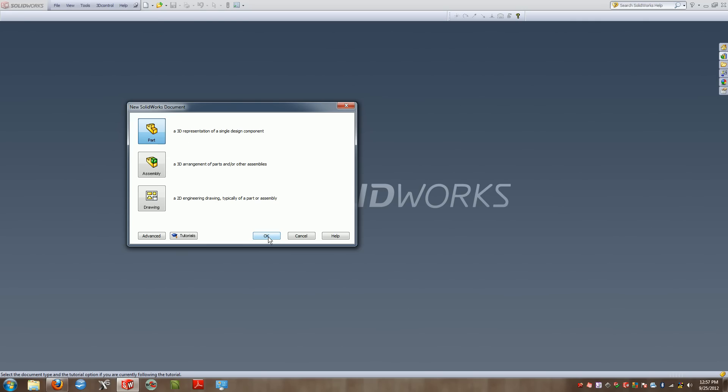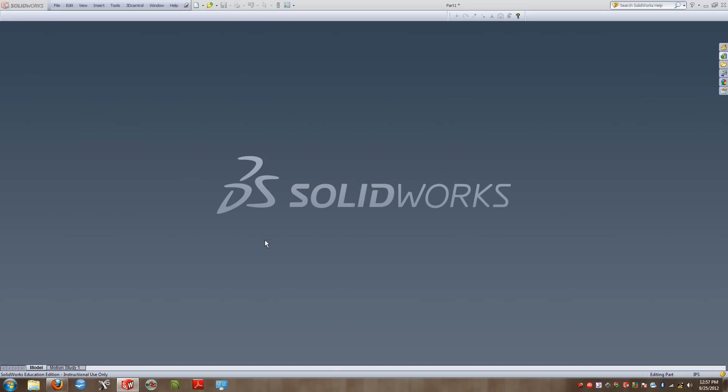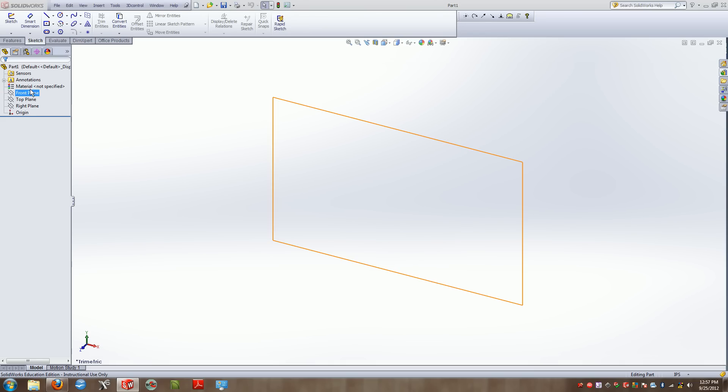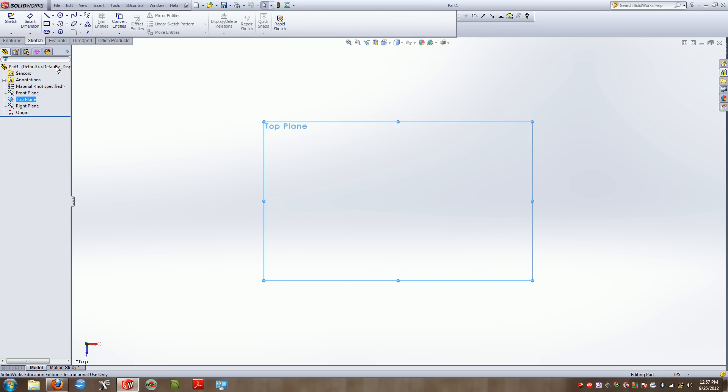This part is going to be done in inches, so I'll select OK. For this particular drawing I'm going to be starting from the top plane, which will be a little different than we have in the past — in the past we've selected the front plane. I'll select the top plane, go normal to it, and start my sketch.